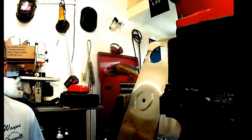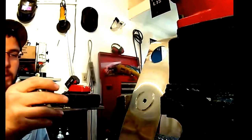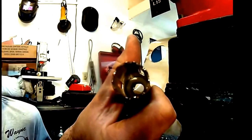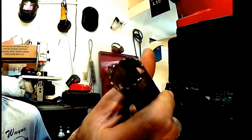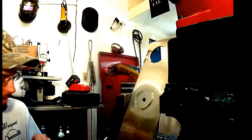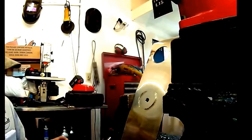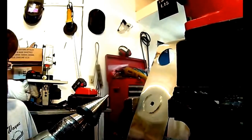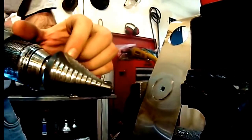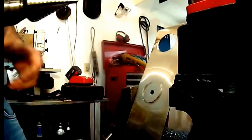That's what stainless steel is going to do to your conventional drill bits. Here's a one-inch hole saw — first encounter with stainless steel, this is what's going to happen. You're going to have flattened off teeth and a whole bunch of frustration. Well, there is a video out where somebody uses a step bit like this to go ahead and drill through there. Basically it just steps down each size, and that did seem to work pretty well — we'll go ahead and give that a try.